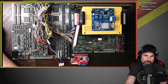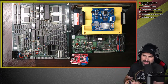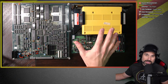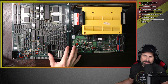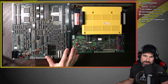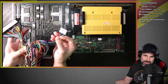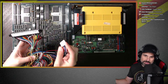This is going to be a fast but mandatory one we really need to cover. Over here on the table we've got arcade hardware. I have two boards: a Konami Teenage Mutant Ninja Turtles PCB and a Neo Geo single slot — actually a multi-cart board. A lot of people want to get into this but aren't necessarily wanting to hook them up to CRTs. If you do hook an arcade board to a CRT it's fairly easy — you hook up your JAMMA harness to your PCB, and at the end of the harness you have a CGA adapter that plugs right into the monitor chassis and your video is taken care of.